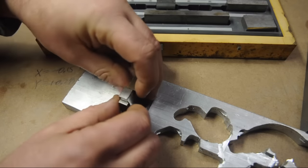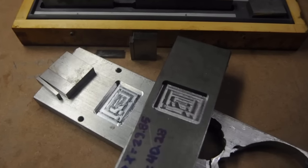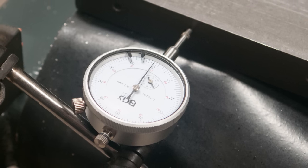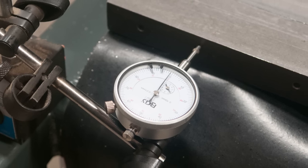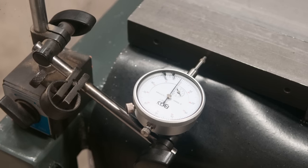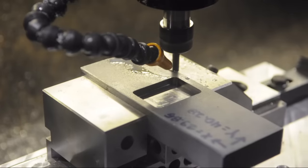The only thing I did different between the first pocket and these two is turn on backlash compensation. I thought I was doing good. So I sort of left it at that, but I'll be honest, it really bugged me. I went back the next day and checked everything again. I used a more rigid indicator setup and went through it one step at a time in both X and Y. As it turns out, I've got a screw loose in every sense of that expression — in particular, the screws on the Y-axis fixed bearing block. Two had backed themselves out and the other two were loose. Once tightened, the backlash on the Y-axis was less than a thou — six tenths in fact. Y was a lot looser than X, but X was harder to get to, so I let X slide for now. Once I buttoned that up I tried another cut, this time in a small vise — it really helped get that noise down.